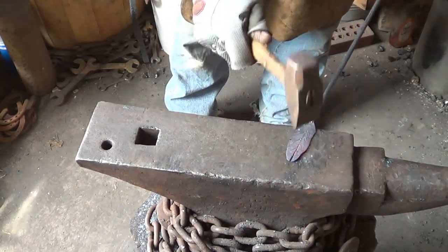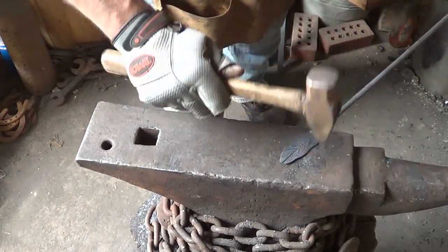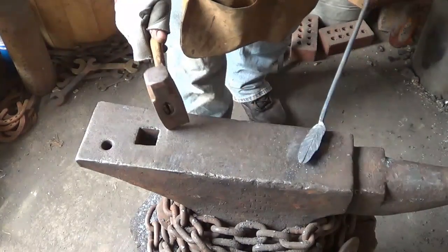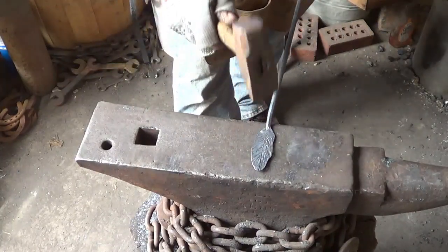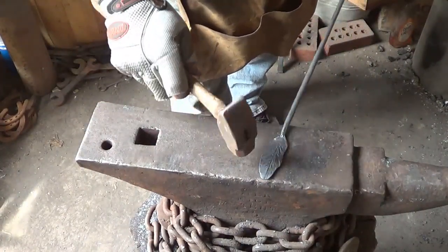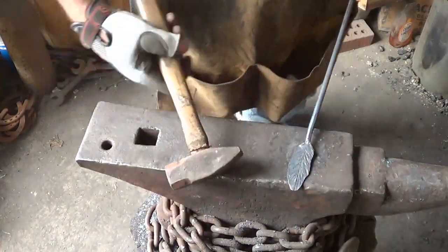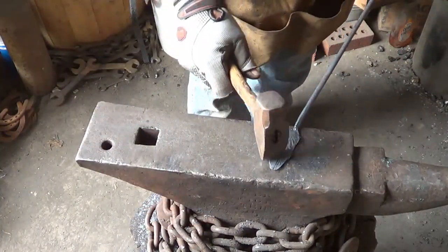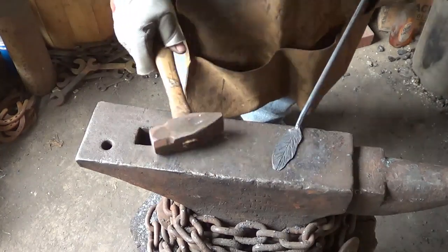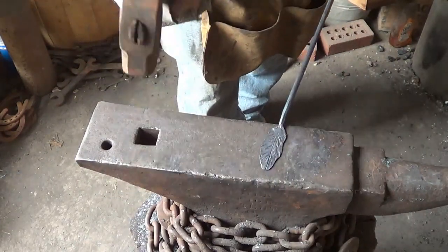Small cross peen — just put a bunch of texture rolling up to the point. Actually, that split and that leaf will look good. Typically I do the texture before I put the lines in, but we all mess up. I like that split now — we're getting a little organic nature, kind of like a split in a feather. On a black heat you can still do this — put the texture in with whatever you use for texture. I use a small 2-pound cross peen hammer. In that same heat, very often you're able to go back and put the lines in. Putting the texture in after the lines softens the lines more. It's totally your call.